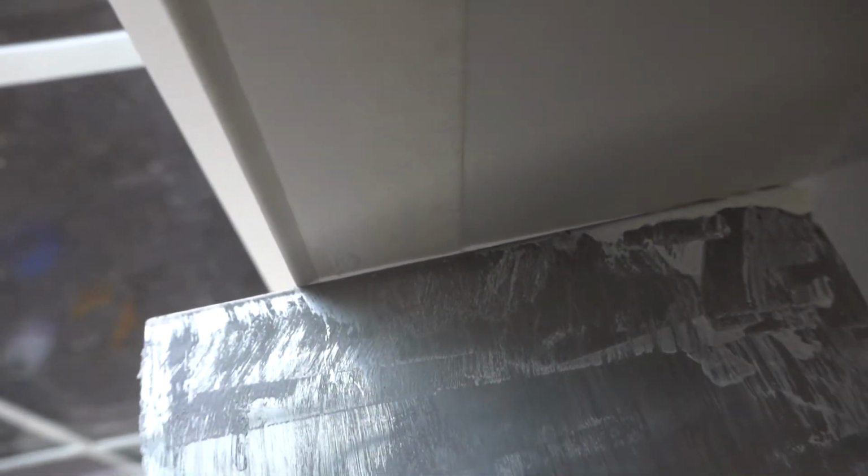One last thing that you want to do is take your drywall knife and have light coming through from the edge going to the wall, just like that one. If this is sitting flush like that, you want to relieve some more on the inside. You might have excess joint compound or extra material. Take it off, relieve some off, but make sure that there's light going through.